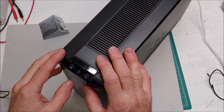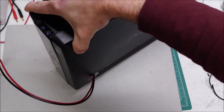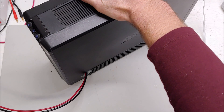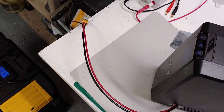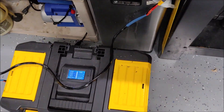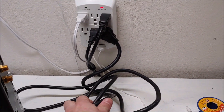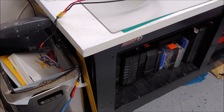I have to say, looks like this diode does work. Even though the APC, when it's plugged back into the wall, suddenly thinks there's no battery, it still seems to click back to the battery when you pull the power, and the battery does kick in through the diode. The meter over here says that there is zero watts coming in — so even though this thing is plugged into the wall right now and it should be trying to charge the battery, because it can't see the battery through the blocking diode, there is zero watts coming into the battery. So that's kind of cool — this blocking diode is doing pretty much exactly what we want it to do.